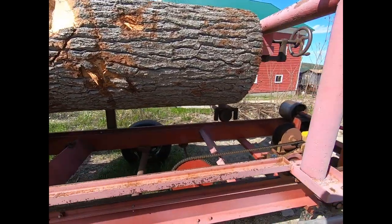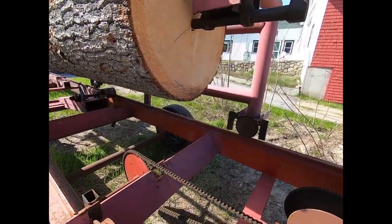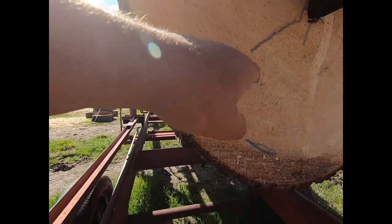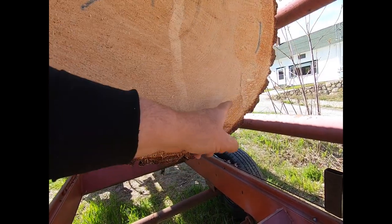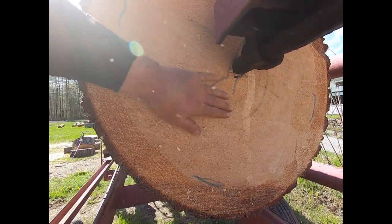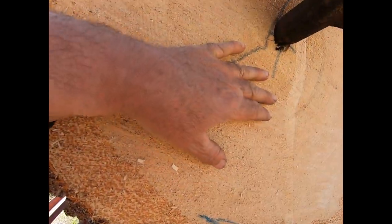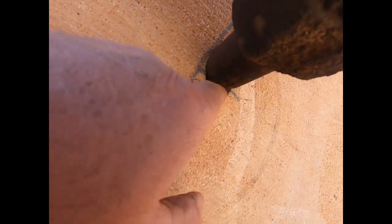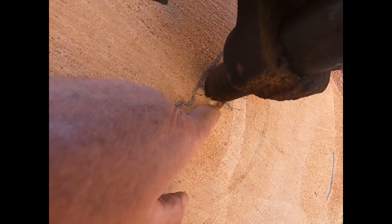I'll show you the other end — it's easier to see. It's pretty easy to find the edge of the sapwood on pine — basically just a difference in color. No pitch here at all. But when we started there, you can see that we didn't have it in quite far enough, and it started sliding up with the fibers. But we'll walk that in a little further and she'll hold.